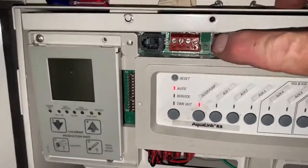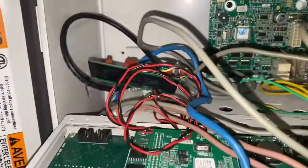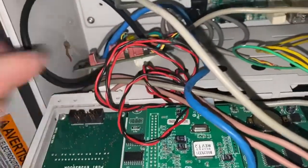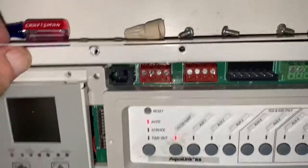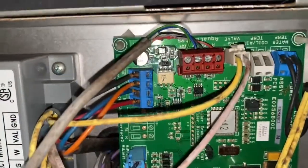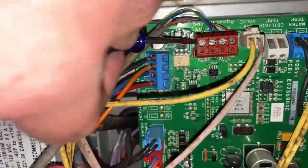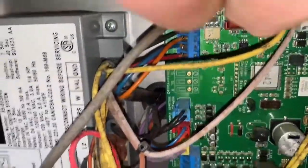That's a typical scenario. If you run into that, you need to start disconnecting all of your RS-485 connectors until you get the control panel functioning right, then one by one put them back and see which one is causing the headaches. We are back at the heater and we are going to pull this 485 port out — simply disconnect it.